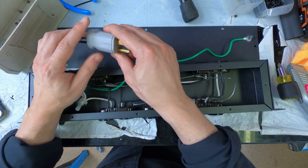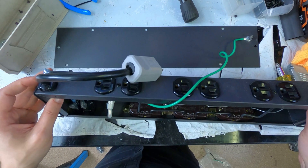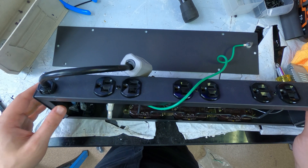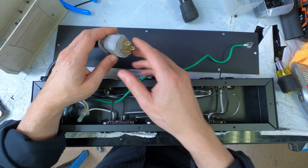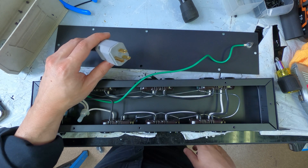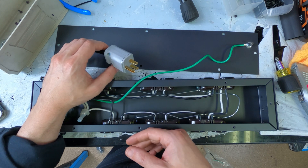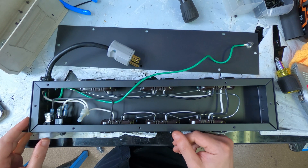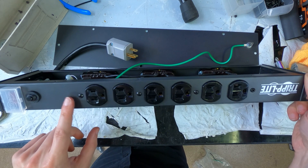What we're going to do is make this a receptacle — it's currently a male, we're just going to make it a female. That's the easiest way to deal with it because it has this cable grommet in here. To take this out you'd have to break it, and then there's a hole I'd have nothing to fill. So I'm just going to make this a female outlet, which will actually be kind of cool for the install — if you have something like a wall wart, this gives you a nice place to put that. If I could get True connectors right now I'd probably make it locking, but those have been on backorder for months. I'll just go with a regular Edison outlet. I'm going to take all this apart and then sink a PowerCon right here.